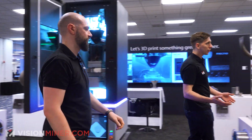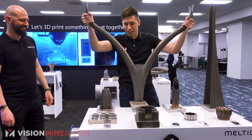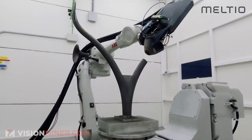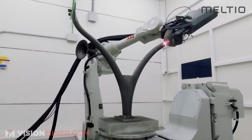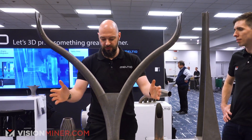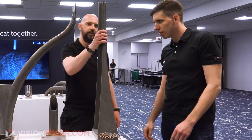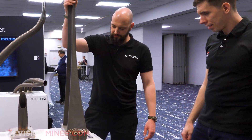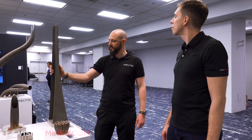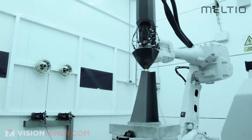These weird antlers are actually a conveyor belt support. They are replacing — by assembly consolidation — one part that was made out of eight bent steel and welded pieces, and now it's a single part with more space underneath, all out of 316 stainless steel. This is a full structure that is 900 millimeters tall with 0.6 millimeter layer height, all uniform, and it's hollow — literally just the outlines done in 316L.